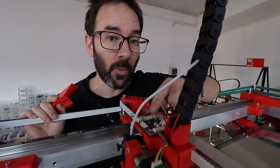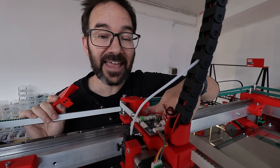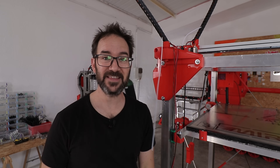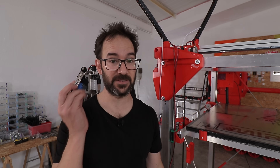The great thing about the Duet toolboard is that instead of the 18 cables I should have brought up here, I can get away with just four: two for power and two for the CAN bus data. The carriage is wired and fed, and obviously this printer is going to eat a lot of filament so it must have a filament runout sensor.